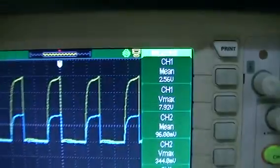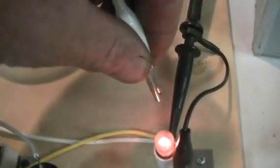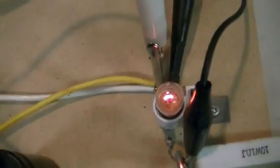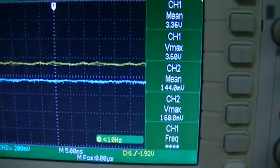We'll do it once again. With our cap disconnected, our mean voltage across that globe is 2.56 volts and the current flowing through it is 96 milliamps average. Once again we'll hook our cap up. Connected — disconnected — connected — disconnected — connected. The light bulb dulling off tells us there is less current flowing through that light bulb. But our scope is showing a high voltage across that light bulb, which means an increased current flowing through it. So the scope is showing us what we should be seeing, but the light bulb says no, that's not correct.